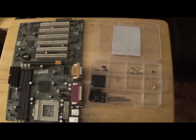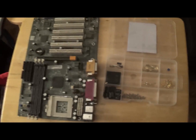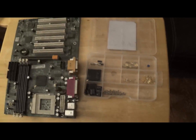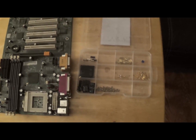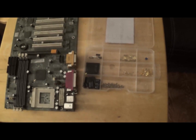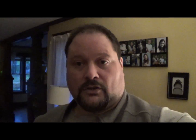Now, the material that Jason from Mountain Baker Mining and Metals gave me — which was these crushed boards — a lot of the lighter material was removed, and my experiment was just to pull out the gold. Not the silver, not the palladium, not the copper, or the aluminum, or brass, or steel. So the results that I came up with are not a complete value for the material that this crusher creates. In quantity it is worth it, especially if you're a company or a group that can process large amounts of material. A machine like this, you're going to be able to get everything out quite easily, especially since larger companies are probably going to use some kind of leaching method instead of AP. They're going to have other methods to extract all the metals out.